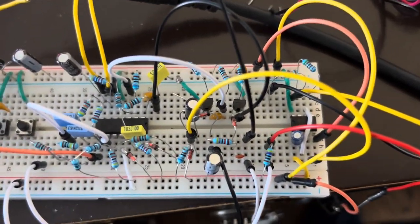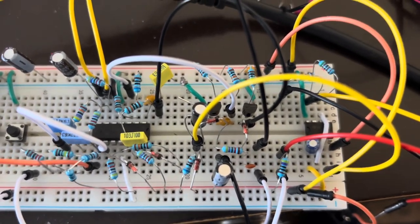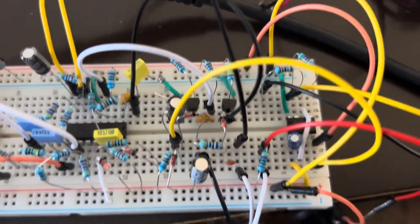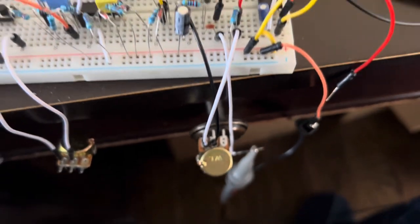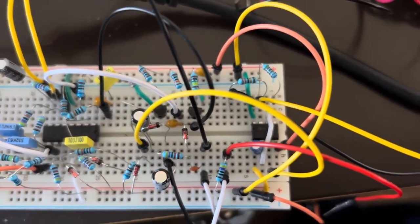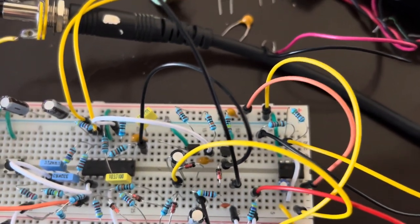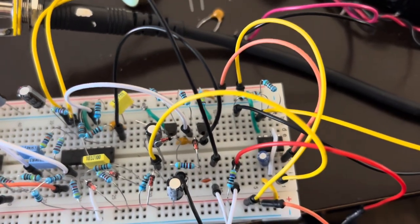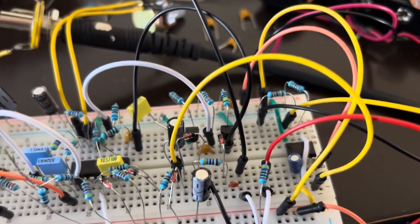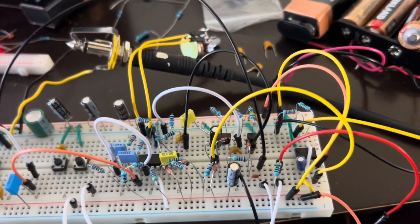And this is a better hi-hat circuit. Same white noise generator as before. Now, using that amplifier to pre-amplify everything instead of using the transistor, and then there's a decay through this potentiometer, and all you have to do is change a couple of capacitors and put a very small capacitor to ground as a capacitor voltage divider, and another really tiny capacitor to the output, so it only gets the high signals through, and it becomes a lot higher.